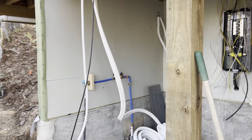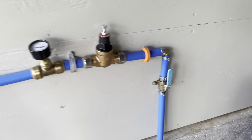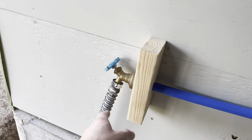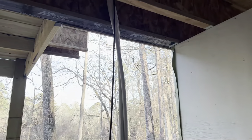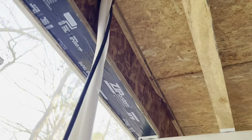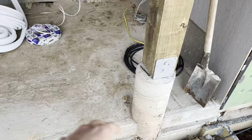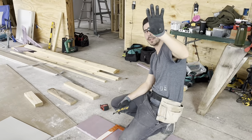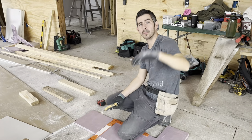We're working on finishing out our little mechanical room. I've got the main water line coming in here, and right now I just have it set up with a pressure regulator and a gauge to keep the pressure in check, and just a temporary hose bib set up. These are the line sets for the air conditioners — I just have them hanging down and I'm going to have to route them that way and then back towards the unit. I still need to finish building out that wall and then this front wall — there's going to be a door here to get in. Because I'm making that little access panel, I don't want there to be insulation in there so I can check it easily, so I'm going to put rigid insulation against the wall so it's all open in there and a little bit neater.